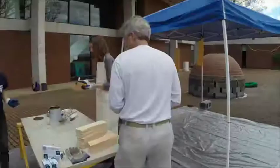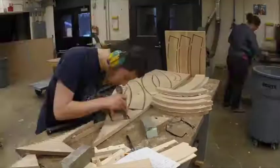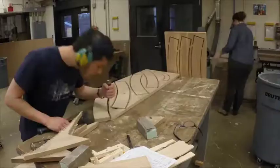The Delorme system is a wooden method of framing the dome. It's based on an invention of Philibert Delorme, who was a Renaissance architect in France. He devised this manner of creating the image of the dome out of wood laminated timbers put together in a very specific way that would make it possible to create a dome without the expense of cutting it out of stone or building it in brick.